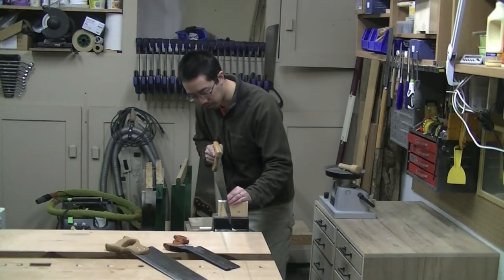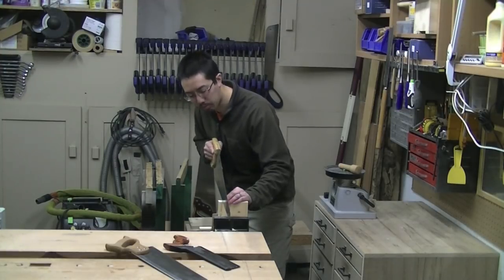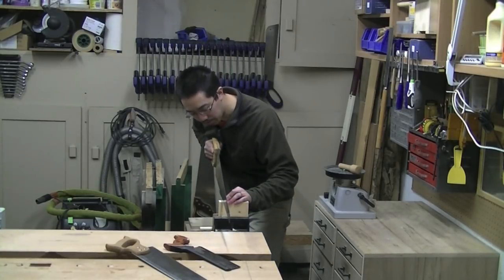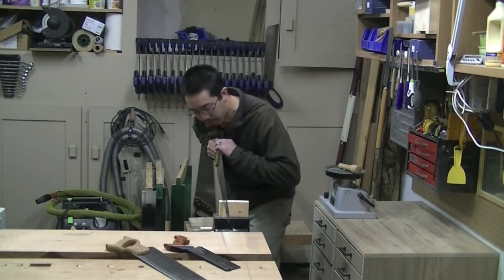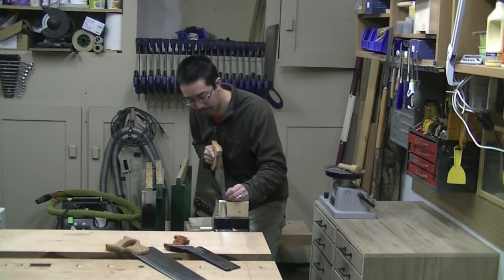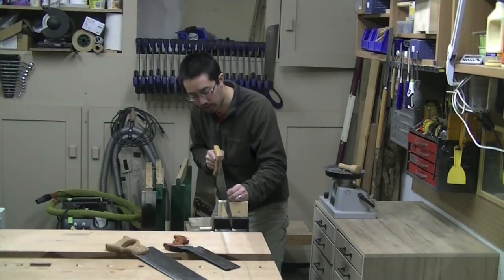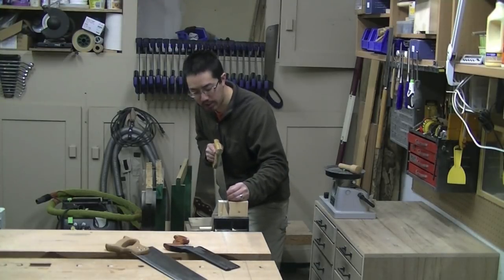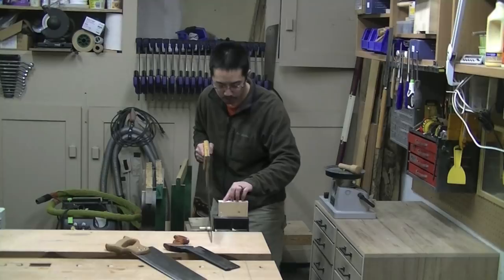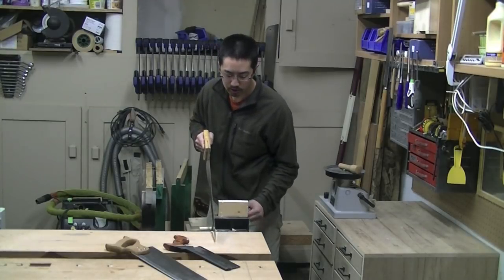Starting a saw is actually one of the hardest parts of learning to saw. What often happens is that a novice will set the material down on their cut line and start pushing down and forward. What that does is bed the teeth into the material, requiring quite a bit of force to get unstuck — if you can at all. The result is a very jumpy cut: the saw skitters around and slides off the intended cut line, causing damage to the end of the board.